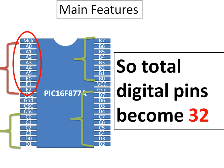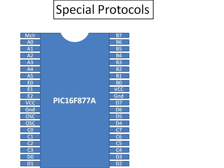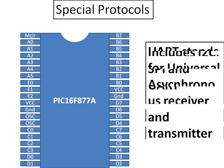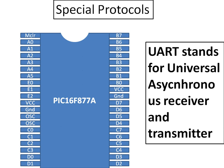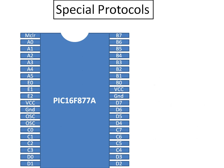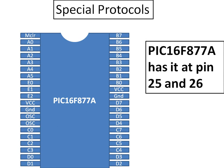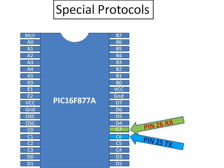There are three world's most-used protocols available: I2C, SPI, and UART — these three protocols are the backbone of any microcontroller for interfacing external modules. First, UART stands for Universal Asynchronous Receiver and Transmitter. It requires two pins: TX (transmitter) and RX (receiver). On the PIC16F877A, they are located at pin 25 (TX) and pin 26 (RX). Using these two pins you can connect any UART module or device, including connecting the PIC to a computer.